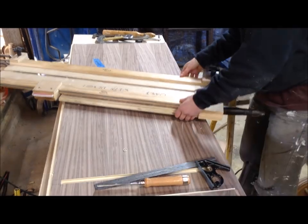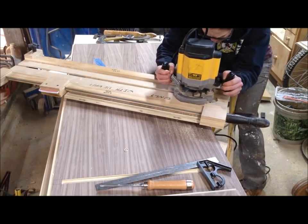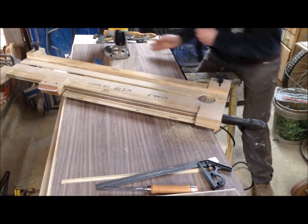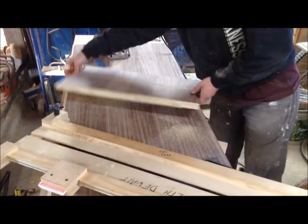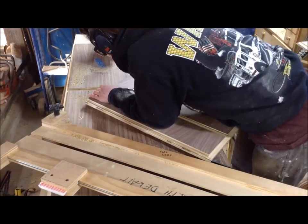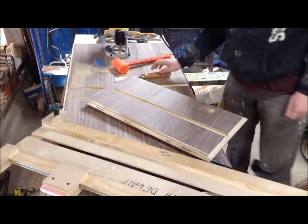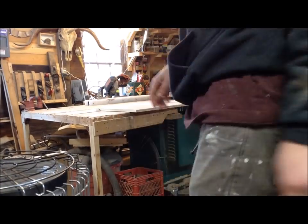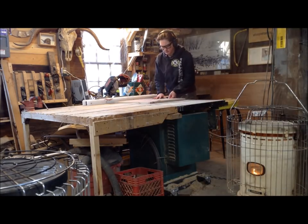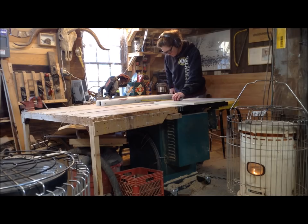Next up were the dados for the two sides on those smaller panels. The router bit I chose for all of this is a quarter-inch downcut spiral bit — I chose it even though it's a little small for this because if you use a three-quarter-inch bit, all your dados will be loose since this plywood is a hair under three-quarters of an inch. The downcut spiral bit is your best bet at avoiding tear-out. Once all those were cut, I was able to put it all back together, take measurements from my two vertical partitions, and cut those on the table saw — one in walnut and one in maple.